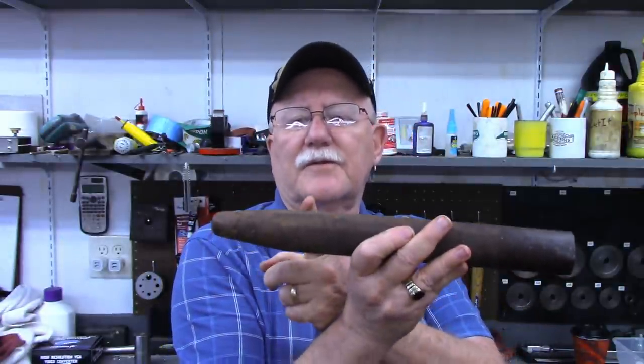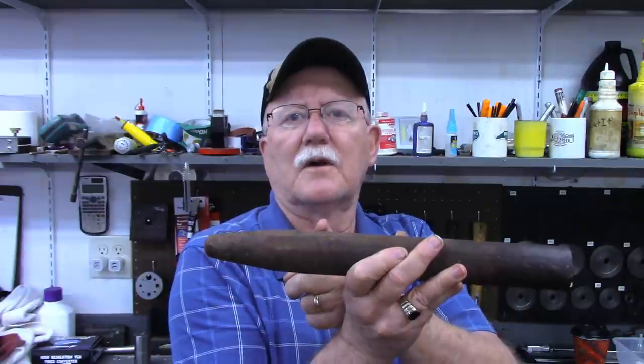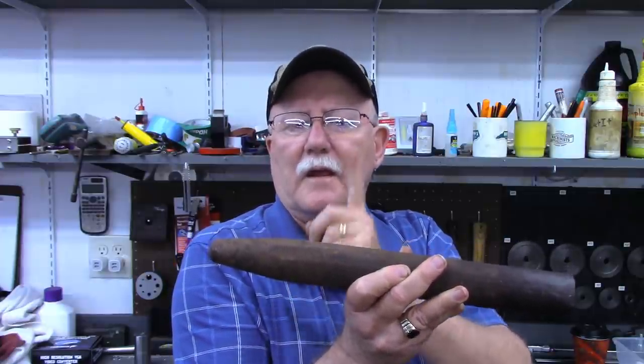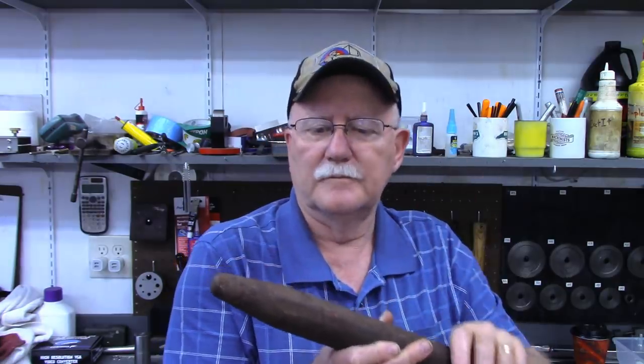So I'm going to carry this over to the saw. It's got a little flat on this side too. I'll probably cut it off along here at this point on the saw. Then put this piece in the forge and get it red hot so that we can drill it to put our legs on for the welder's third hand.